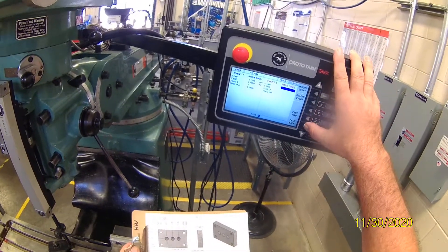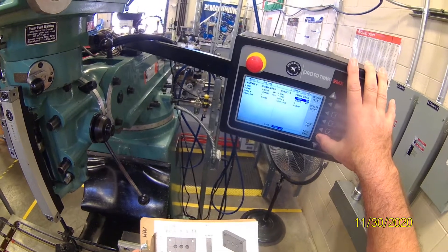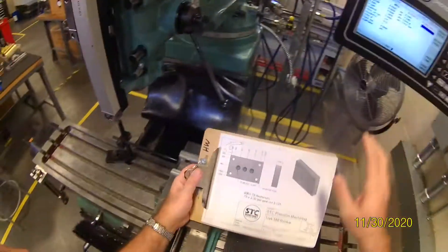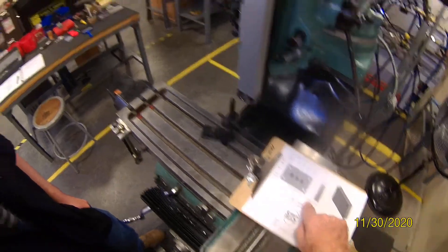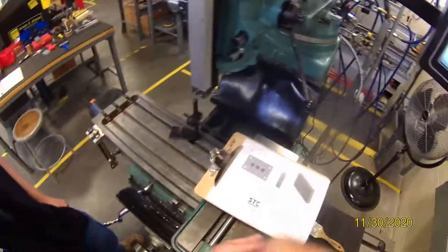So let's go back — we're going to reprogram the drilling. Delete, delete, delete — I'm starting over. From there, you can just do the drill: do the four outside holes, call them 250. Then this one I would call tool 3 at 375. So you get your program, and you can swap the drills as needed or the end mill. The end mill is pretty easy. Then I'm going to go over the setup — how do we set this up? Thanks guys.